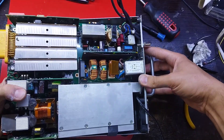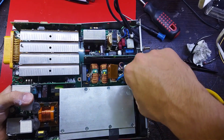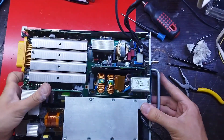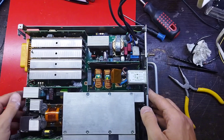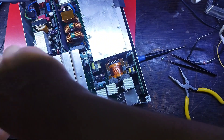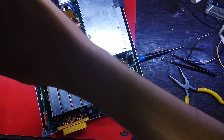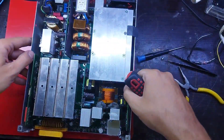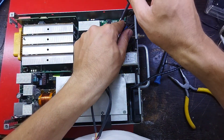In a linear power supply, the AC input voltage passes through a power transformer and is then rectified and filtered to obtain a DC voltage. The filtering reduces the amplitude of AC mains frequency present in the rectifier output and can be as simple as a single capacitor or more complex such as a pi filter. The load's tolerance of ripple dictates the minimum amount of filtering the power supply must provide. In some applications, such as battery charging, the power supply may consist of just a transformer and a diode with a simple resistor to limit charging current.